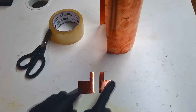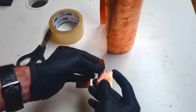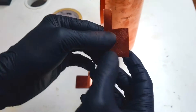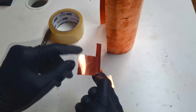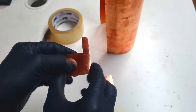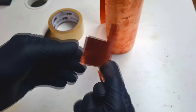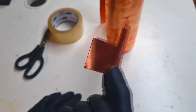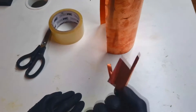Out of this copper foil I cut out two electrodes. In this solar cell, one electrode needs to be made from pure copper, and the other electrode needs to be made with copper oxide. The red copper oxide is the material I need on this electrode. To turn the copper electrode into red copper oxide, I simply need to put this electrode on a hot plate on full power for around 20 minutes.